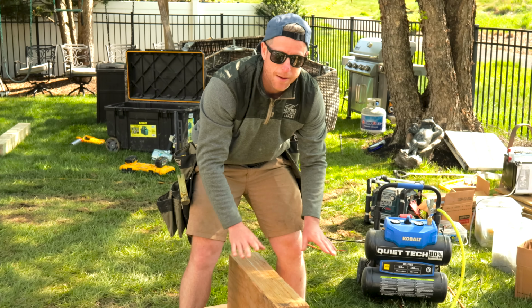So it's gonna have a bird's mouth at our beam on the outside and at our ridge beam. So they're essentially gonna go like this right here. That is the confusing part of figuring out what is our overall run to set our ridge. So what we did is essentially figure this out like we're not doing a ridge rafter or a ridge beam at all. We're taking it off this top point because our rafters are gonna meet in the center. Then we're gonna do 2 inches here, come down, and that's gonna create our notch around our beam.